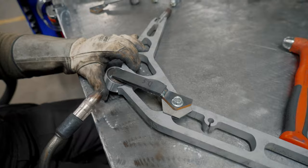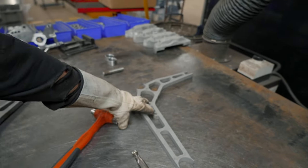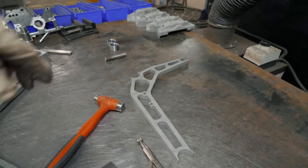That's a nice jig. So how do you make a jig? You gotta get one in the right spot, and then once you get it in the right spot you just kind of find a good reference point. On these arms, the only two real solid reference points are these holes here — we're always looking for something to bolt it to, just to constrain it as much as possible.